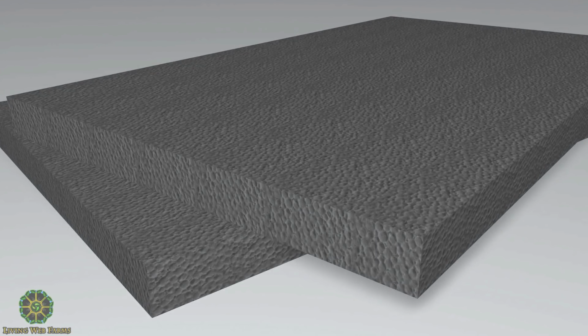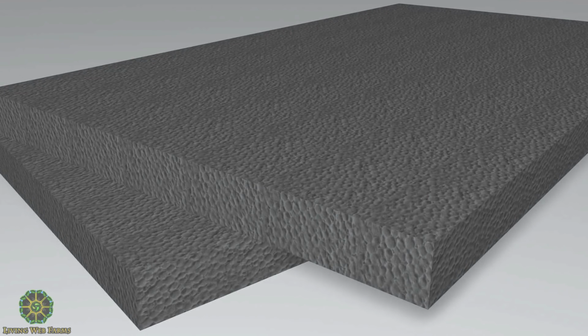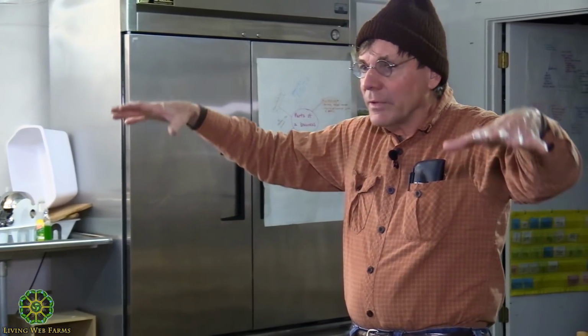That is a denser, stiffer, more durable, and completely waterproof material. And it's easy to cut. It has a very high modulus of pressure, so they use it underneath slabs. That's the stuff they use underneath slabs when they pour even thick slabs, to keep the soil separated from the cement, so you don't have a migration of heat from your building out into the soil. So all that weight of concrete just doesn't crush it. Whereas the expanded polystyrene is so foamy that it would just flatten and make an uneven surface.